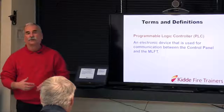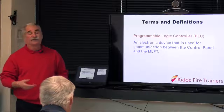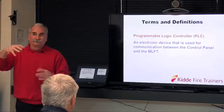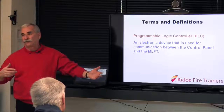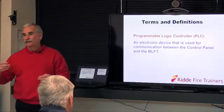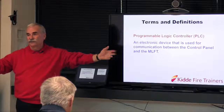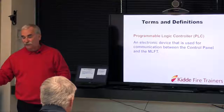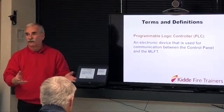It's all being run through a programmable logic controller — a PLC, which is essentially a dumb computer. You send a signal in, like turning a switch, and the PLC program tells something to turn on or turn off. In the old days it would have been done with relays. In this case with the PLC, if you turn on a pilot switch, it's going to open a couple of valves, turn on an ignition transformer, and create a pilot.